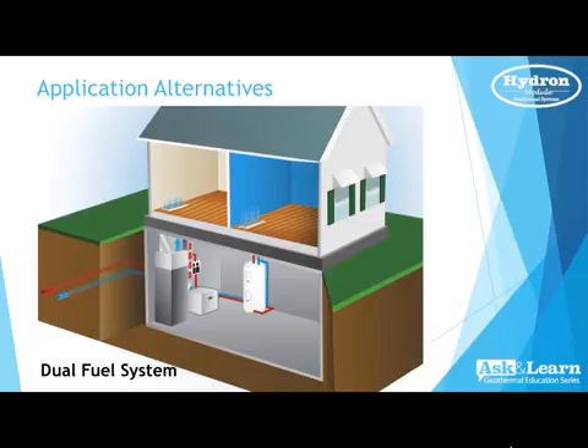Dual fuel is a big hit, especially if you want to keep your natural gas or propane but use it as an augmentation device with geothermal as the primary source. When necessary, the gas furnace would serve as a third stage to finish the heating cycle. We should also mention de-superheaters — these assist in making hot water during the run cycle in either heating or cooling mode, which is another big factor for energy savings; they can make your electric and hot water bills nearly nothing during summer. With dual fuel you can also keep a gas fireplace, gas range, gas hot water heater, outdoor heaters, or even a generator.